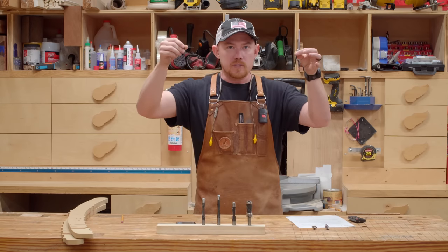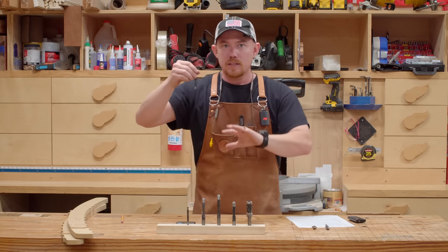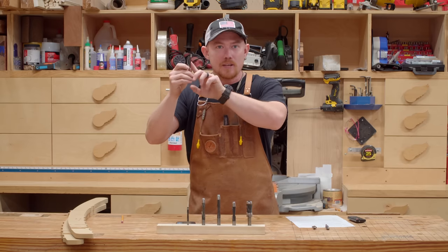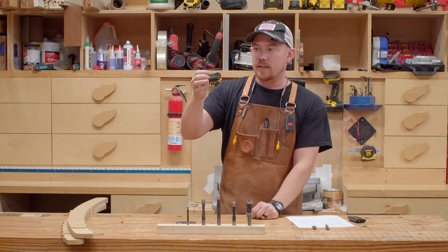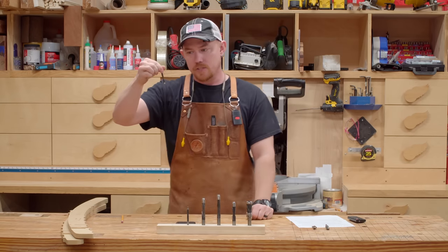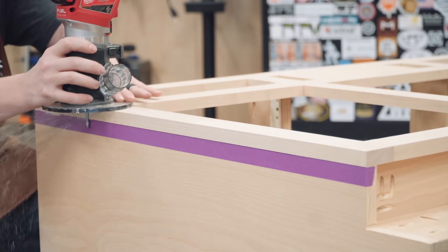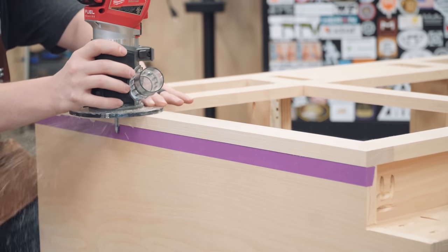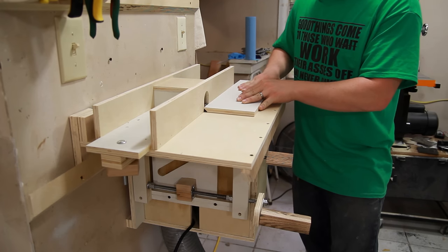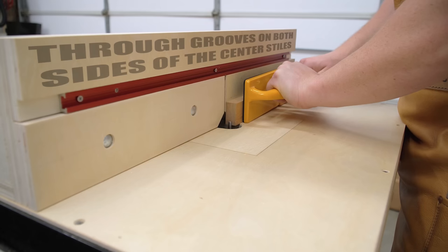This other one over here is the opposite — it's going to push the fibers up. However, when you put these in a router table, it completely flips everything around. In a router table, this orientation is going to push the fibers up, but it's still a down cut bit. Same thing with cut direction: on a handheld router you work from left to right; at a router table you approach from the right and work to the left. Everything flips when you flip the orientation.